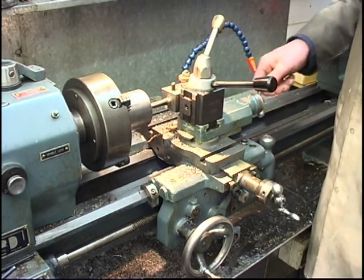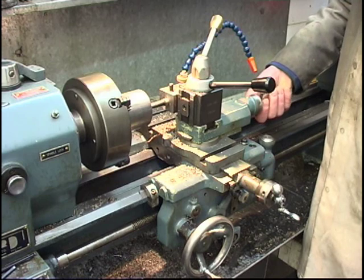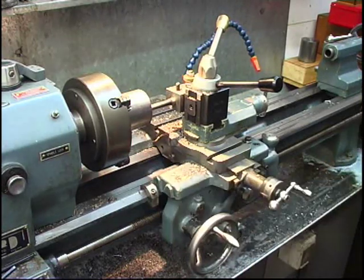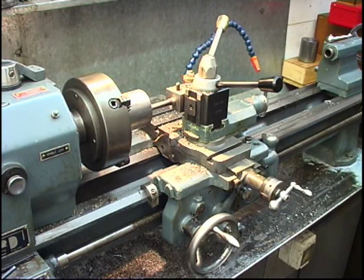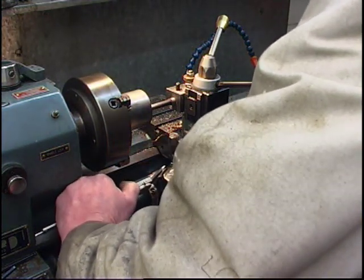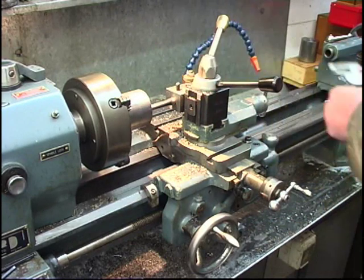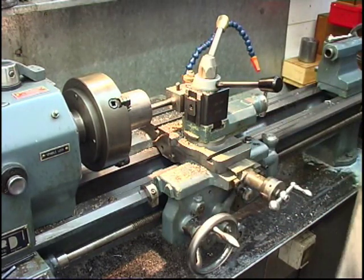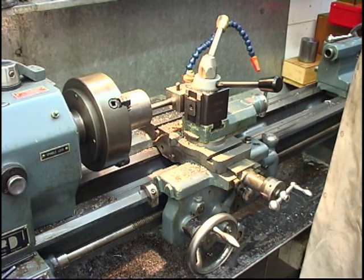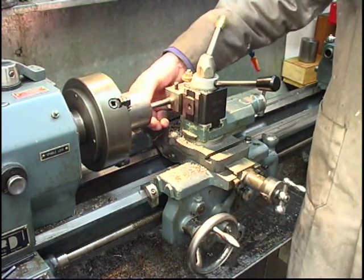One, two, three, 450 thou. So now that's 450 there. And it is 450. Within a thou or two, it's not that critical. I measured some of my chucks and they're 380. One of them's actually got half an inch of a recess, so I'm taking an average of 450. This is where it gets important. We must get this bore size right.